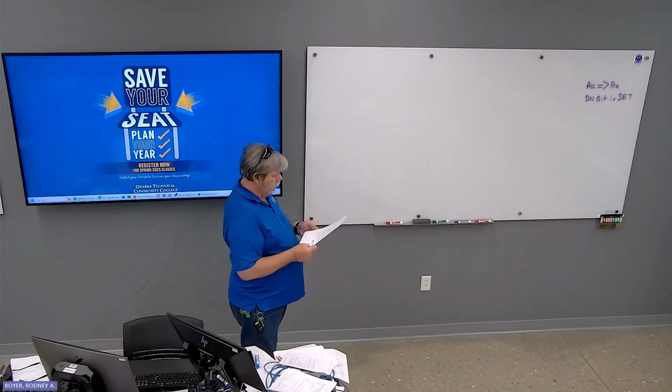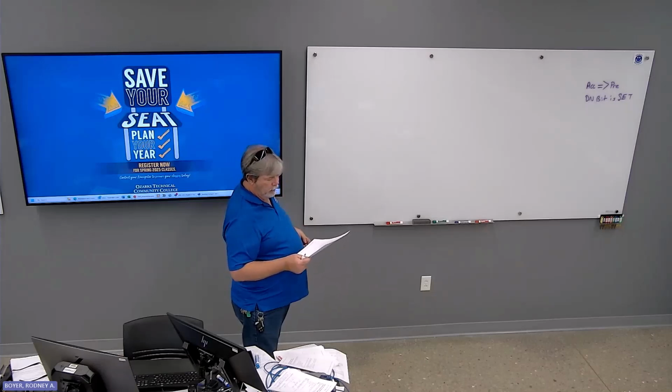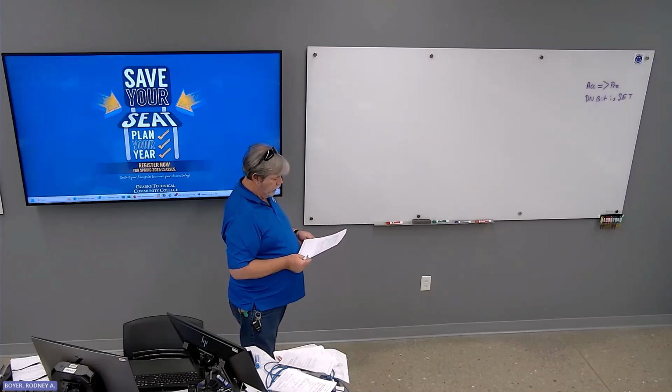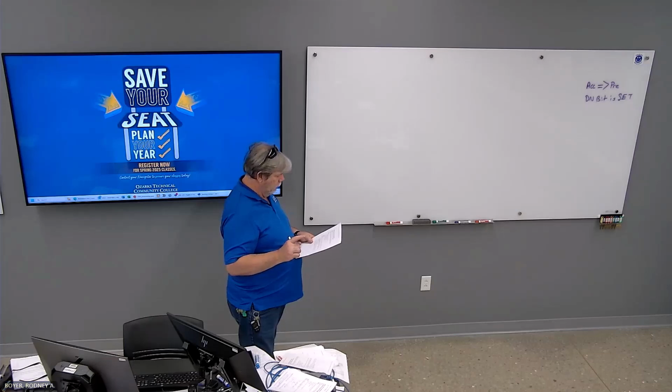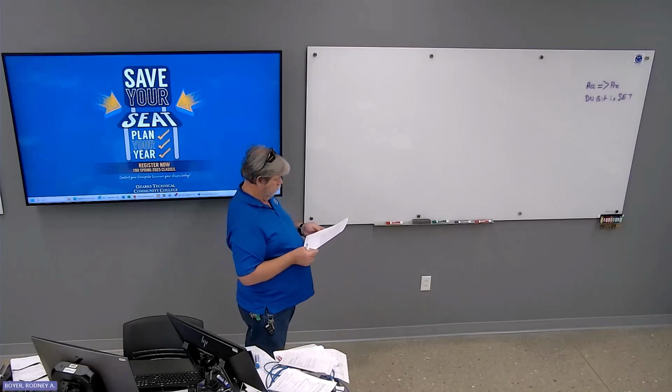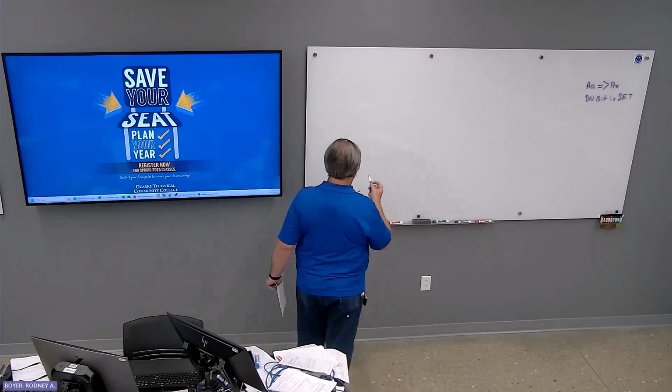In this activity, we're going to create a PLC ladder logic diagram that carries out the following operations. Fan is to be turned on when counter 0 counts down from 7 to 0, and when either counter 1 counts up to 14 or counter 2 counts down from 14 to 0. And then one switch will reset the entire process. Okay.